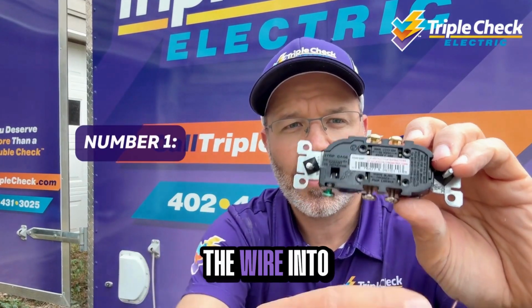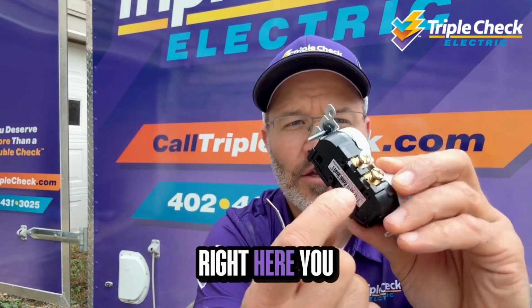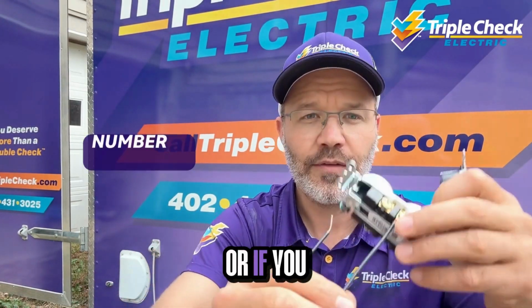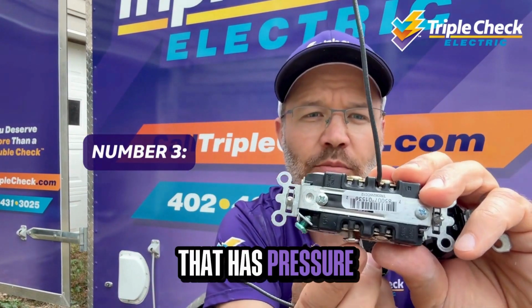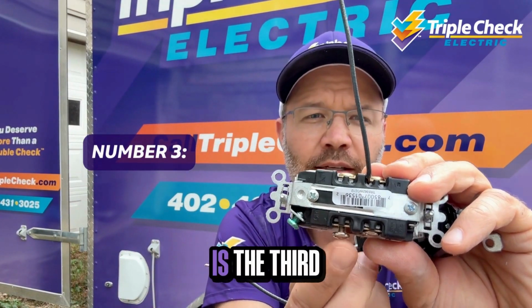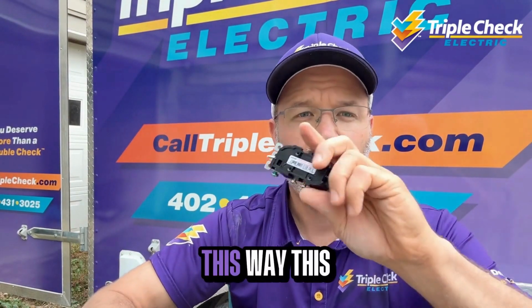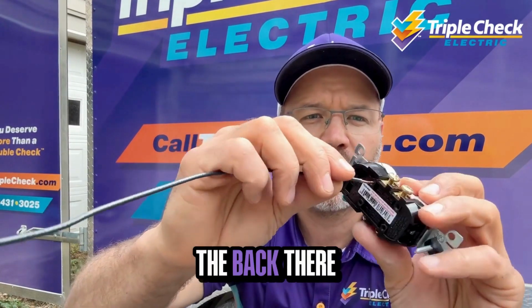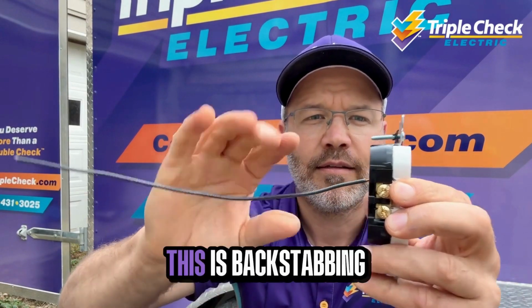You can stab the wire into the back of these holes right here. You can take and make a hook and wrap it around the wire. Or if you have an outlet like this that has pressure plates, when you tighten down the wire is the 3rd way. This way, when you take your wire and you put it in the back of there and you press in, this is backstabbing.